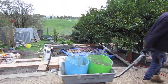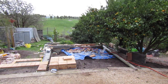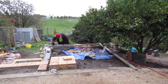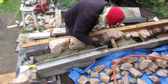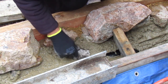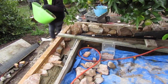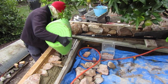We're completing this last course in the wall with the same process we've been using throughout. After wetting everything down, we add the coloured mortar and push it into the cracks of all the stones, followed by our standard grey concrete mix as the general backfill that adds strength to the wall, adding in scrap pieces of concrete to help hold the stones in place, inserting our steel elements, and just continuing to fill the wall till we get to the top of our form.